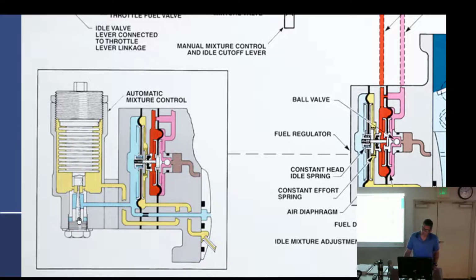An inverted needle. So as we go up in the atmosphere, potato chip bag technology tells us this will expand. And what is that going to do to us? It's going to open up your impact air to your bleed air. Open up yellow to blue. Impact to bleed air, which effectively decreases air metering force, which tends to close the servo valve, which sends less fuel. So, boom, there we are. Mic drop. Okay, now you can change screens.